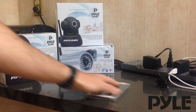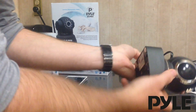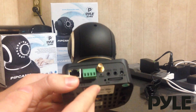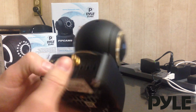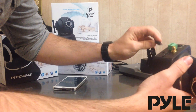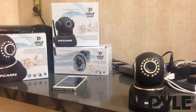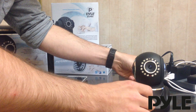To start off, connect your DC power adapter into the nearest outlet. In the back of each camera you're going to see three different ports. One's labeled DC on the far right. They all do look the same, but only one is for power. The other two are labeled audio and mic. Connect that in to get the camera power, and while we're at it, connect the camera's Wi-Fi antenna that came in the package — just screw that in to the back here.